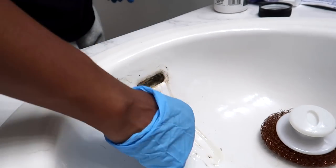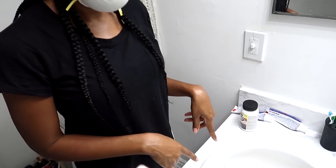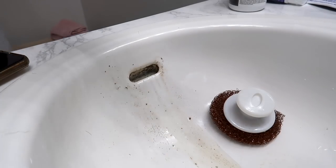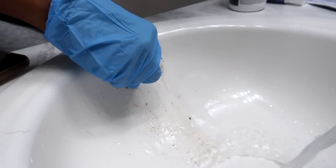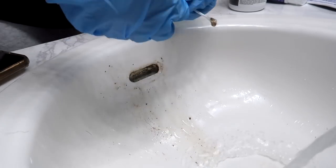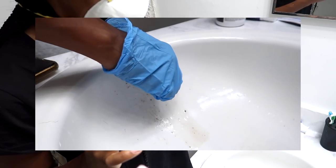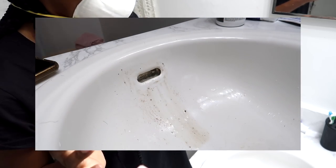So it says to remove the loose rust and dirt from surface. For heavily rusted areas, loosen the rust with a wire brush — that was this here. Liberally brush rust dissolver jelly over the surface, wait 15 to 20 minutes, rinse with clean water and allow surface to dry, repeat if necessary. And then it says to avoid rusting, dry surface with clean cloth or place in a dry atmosphere. Paint or coat surface within 48 hours.